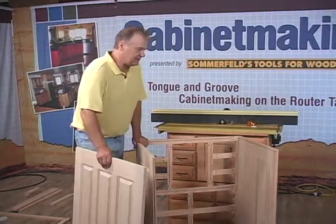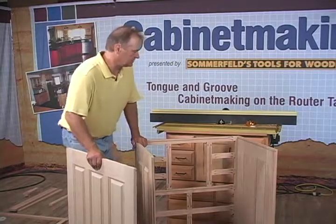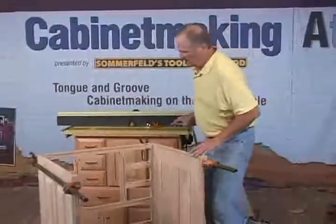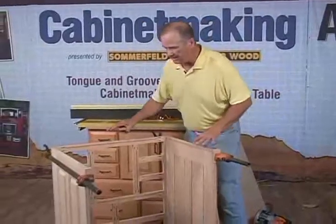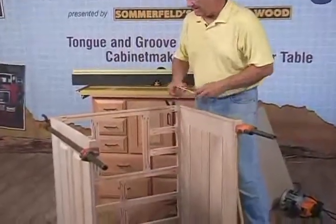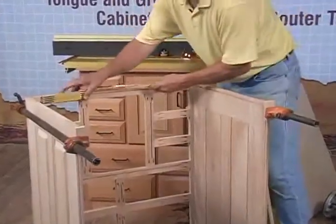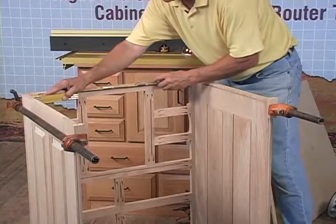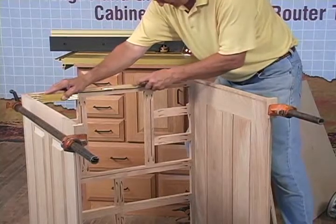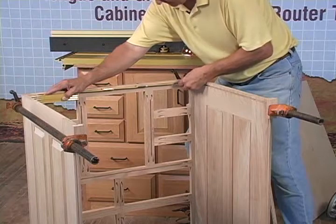We'll put this cabinet together here. We'll clamp it up, we'll dry clamp it up, and we'll show you how we're going to arrive at those measurements. Okay, we got to find how big our shelves, we got 2 bottom shelves in here, how big they got to be. And I like to use this ruler here, the old time ruler where it extends out. We're going to get a good inside measurement here. From here, extend out right to there.